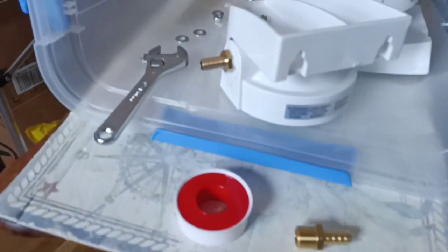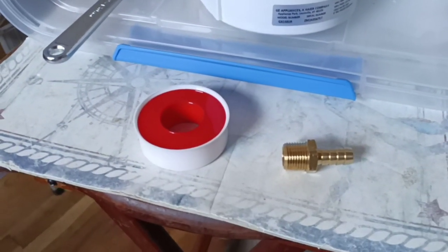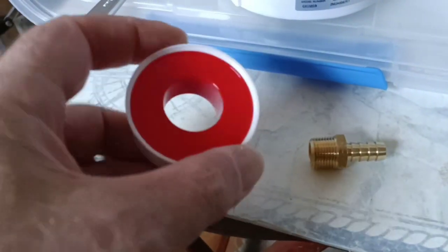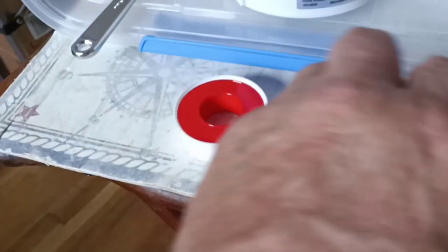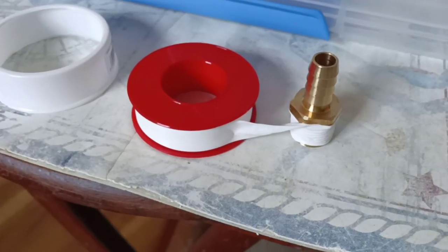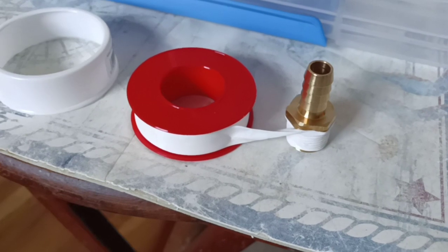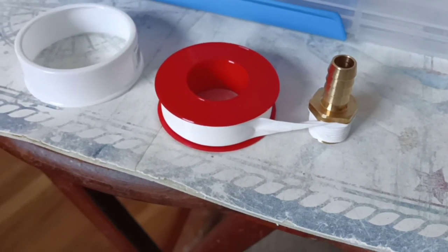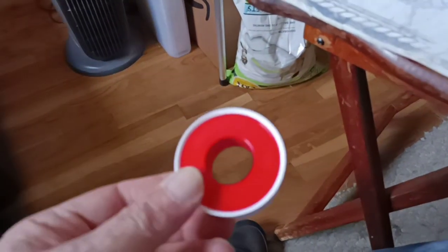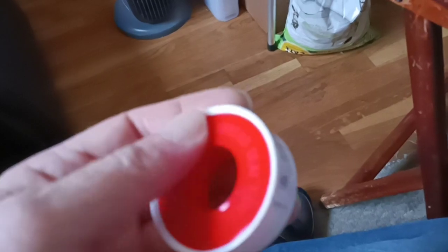The supervisor's back to check the first connection. Now we're going to do the second one on the opposite side so they'll all match up. When you're doing your Teflon tape, put it in the same direction as you're going to screw it in so it doesn't unscrew. Go about three times around - that's twice around shown here - and when you're done just grab it and cut it or pull it. Make sure you don't leave any strings sitting out to clog up the line. Always put the lid back on the tape so it doesn't unreel.